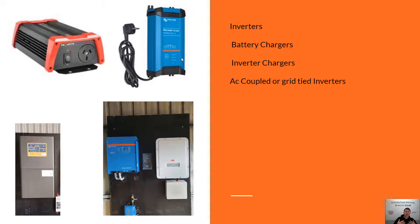We highly recommend that in bigger situations — pretty much if you plan to run anything 240V, a household fridge, computers, lights and things like that — you're better off going down the path of using an inverter charger, like this Victron inverter charger here. There are lots of different products and brands on the market. The main benefit of an inverter charger: when you turn your backup source on like a generator, the inverter charger gives the house power priority first, then any excess goes to batteries. With a separate inverter and battery charger, it can't work that out, and you risk overloading your generator. With some education you can manage it, but it all comes down to budget and whether you want things to just work.